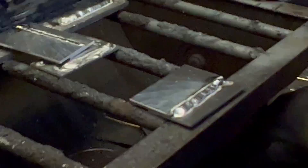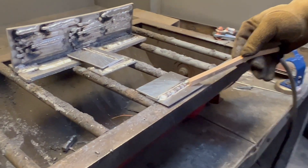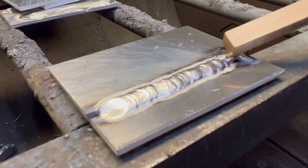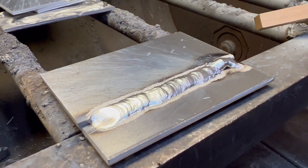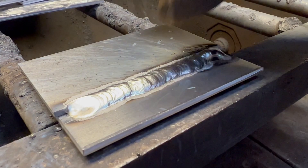As you can see, we didn't program any hot starts, so we have a little bit of cold fusion down here — the toe line is not perfect. Once the heat is built, the weld looks pretty decent going all the way across. With 4043 you get a tiny bit of soot that wipes right off with a glove or a cotton towel.